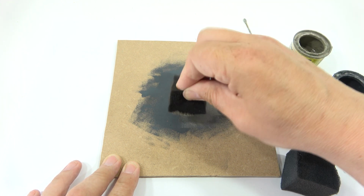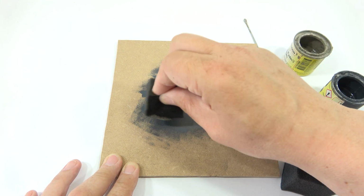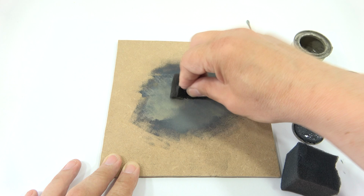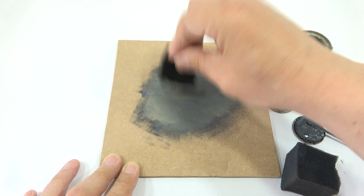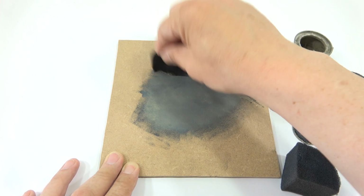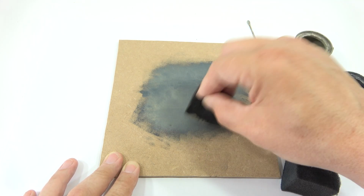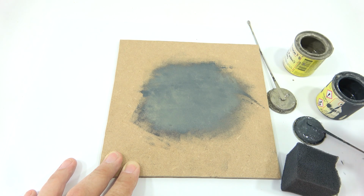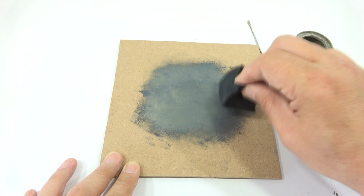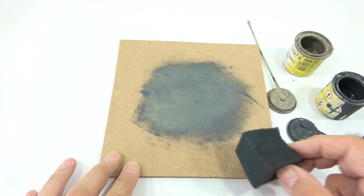Now, you need to work fairly quickly on this sort of thing, because what we're looking to do is blend the colours together so that you don't get just one colour. As you can see, you can actually see both, and you can also see that there are definite changes as you look around my tarmac area. Here we go. And if you think it's looking a bit light, you can dab in a bit more new tarmac, perhaps in areas where cars or vehicles haven't been moving quite as much.